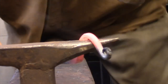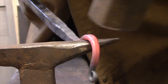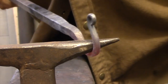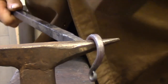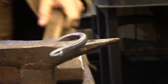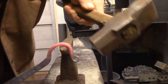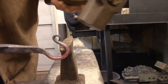I'm going to need to finish shaping this bend over the horn of an anvil — that can either be the horn of your main anvil or, as I have here, a small stake anvil. The reason I have to do that with this one is because unlike the smaller loop where I started from the tip and curled it towards the back, this one I'm starting at the back and working towards the tip. I dipped the tip in water before coming over here because I need to hammer on that section, so cooling it down will keep it from getting bent out of shape.